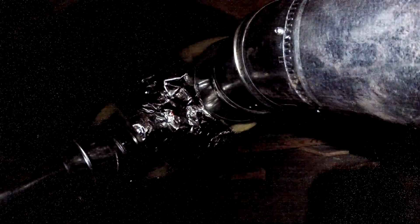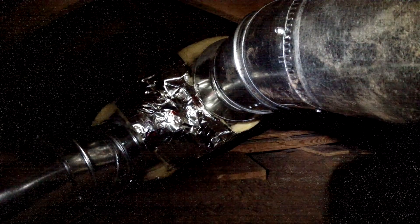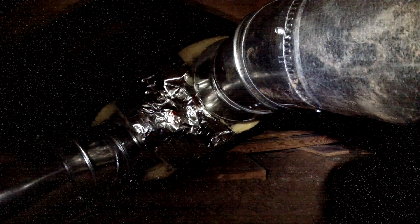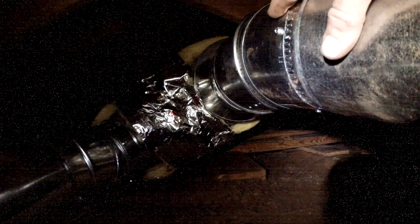It's difficult for me to even turn over in here. This would be a situation where you'd be in the attic looking back in this area and you'd think everything was insulated, and then you'd always wonder why you have such drastic heat loss and air loss into the master bedroom. These lines were never air sealed and they're not insulated.